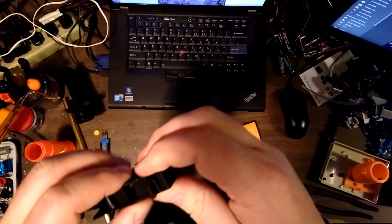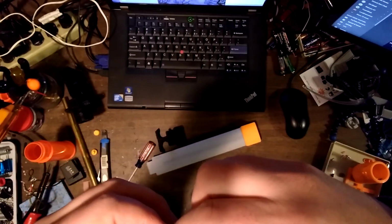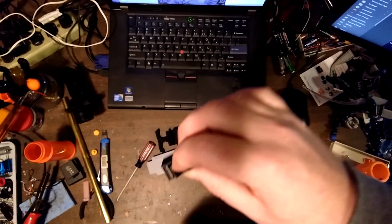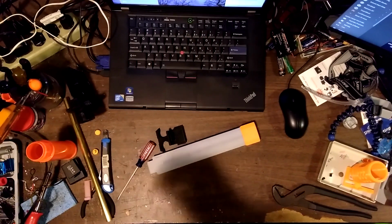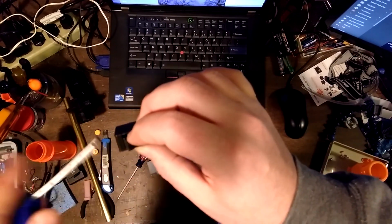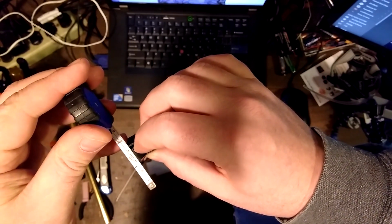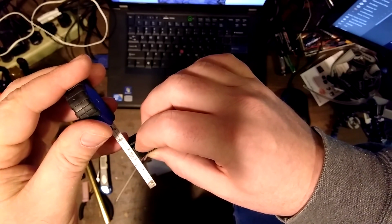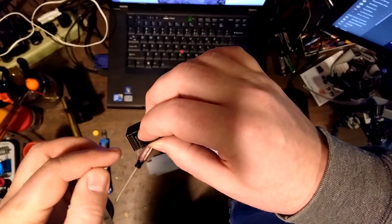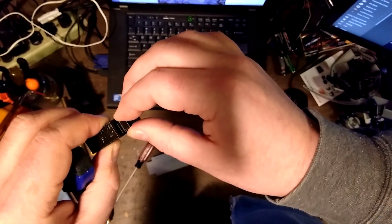So I'm not really much of a CAD person, but I'm going to essentially Tinkercad this, and I'm probably going to add about 1 millimeter to the width. I think I'll start with 1 millimeter, and I hope 1 millimeter is just right, where it can still slide freely, but it won't have this back and forth quality.